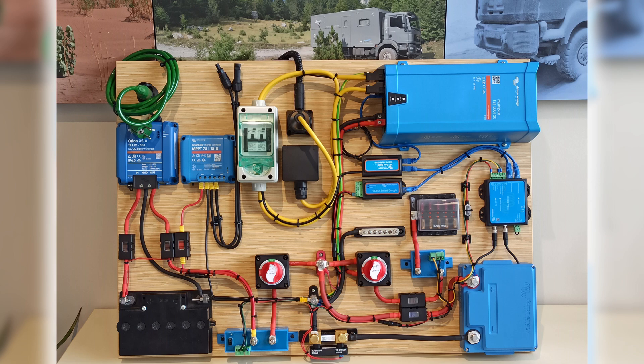Let's move on to the house battery. We use a Victron smart lithium battery with a VE Bus BMS version 2. The BMS controls the MultiPlus directly via data connection and the two smart battery protects via voltage signals. The BMS comes with a mains detect box that is used for all MultiPlus devices except for the MultiPlus 2 models. Any VE Bus remote panels of your choice can be connected in the place where the smart dongle is connected here.